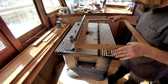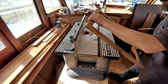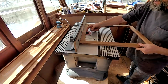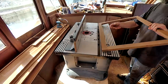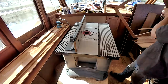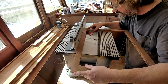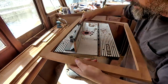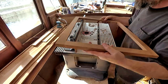That's basically just to get it flat enough for the next step, because I consider levels of effort to be sequential and I don't want to be working too hard making this perfect and then screw it up when I route the dado, which is the next most dangerous thing to do. So it's good and flat - this is looking like a pretty good door. I'm very, very pleased. Let's set up the router table. So I've set up the bit - it's just going to take about an eighth of an inch off, swing it around, do a couple more cuts, and I'll just make deeper and deeper cuts. At the top I have to dig much, much deeper. So the first cut is super stressful because that's where I can do a blowout, but I have a perfectly clean eighth-of-an-inch dado in here now.